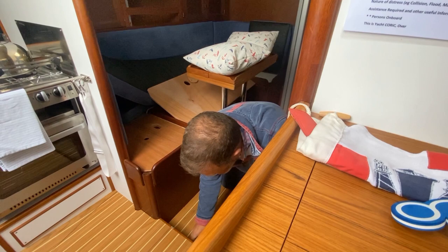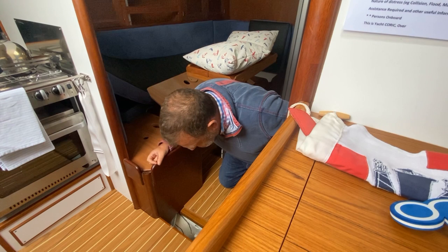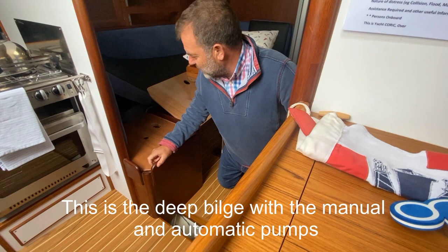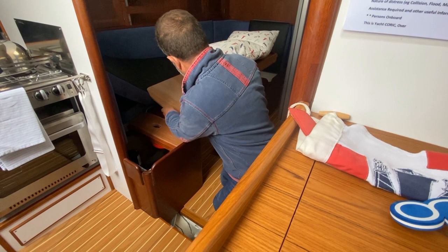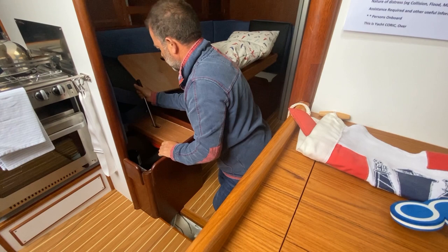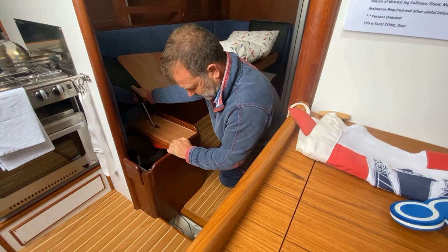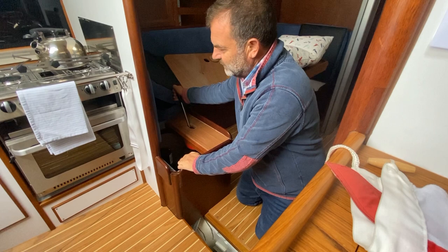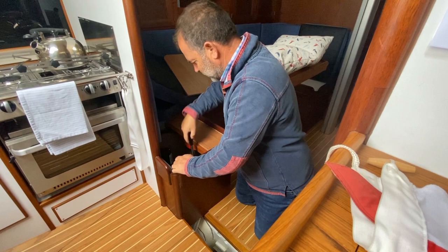What I always like to do is have a good look down inside the bilge. We've been away for three weeks but there's really next to nothing down there — maybe just a tiny bit of rainwater. I'll give it a little pump just to get rid of what tiny bit there is. I then do a few extra bilge pumps because if there was any possibility of gas being down there, that would remove it, as the bilge pump will move gas.